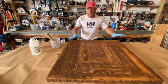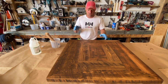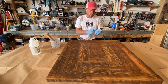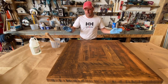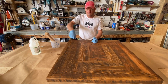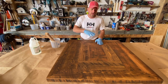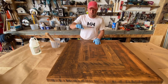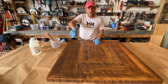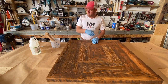Even though I flood coated this with the black filler and sanded it all off, there might still be a little pinhole here or there, and this stuff will just leak down inside it. Rarely have I been able to get a good finish on just one coat. So I do a seal coat — either scraped on or brushed on — and let it set, then come back and do a flood coat. Sometimes there's been a void where a lot of epoxy goes down, so I'll fill that one, sand it, and then do the flood coat.